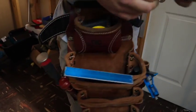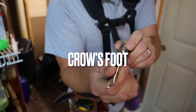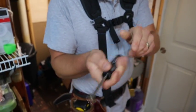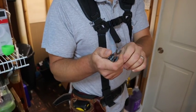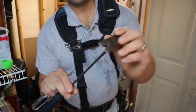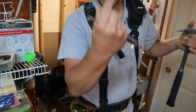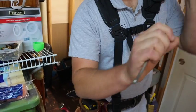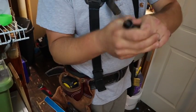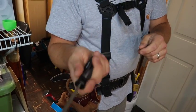In this other little pouch I have this tool — I call it a crow's foot. If you ever try to get a nail out of wood or pry something up, sometimes the claw on your framing hammer is just too thick to really get that nail head out. So a couple smacks with your hammer on the crow's foot, or just by pushing, you can work a nail head up — super useful for prying and getting small things pried out.